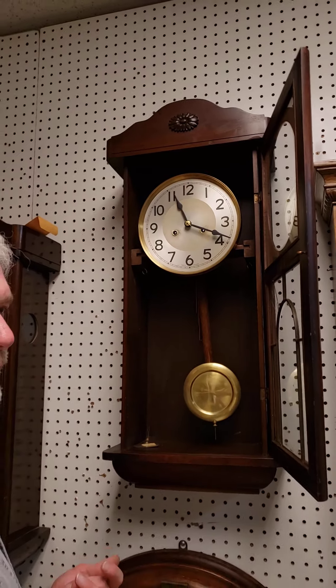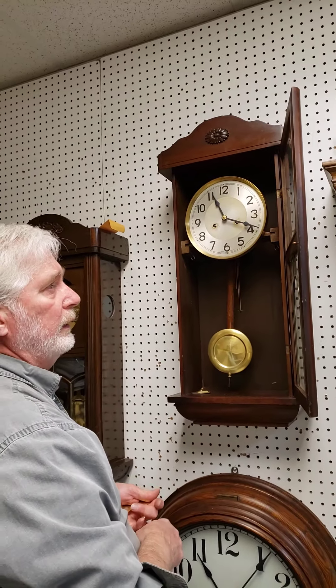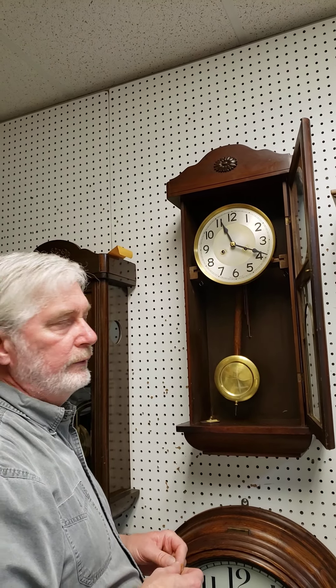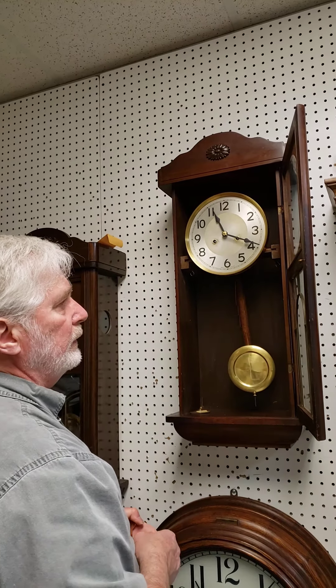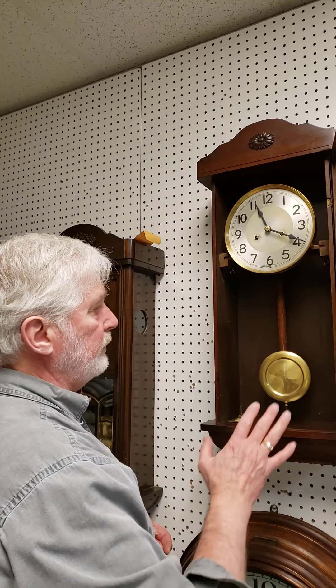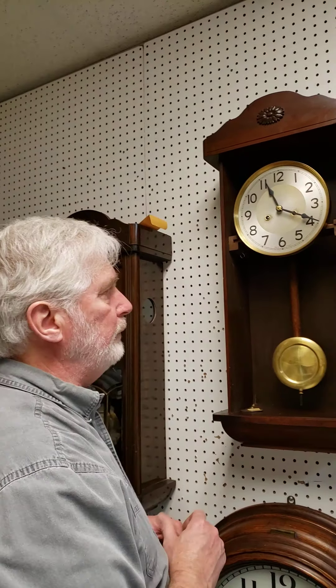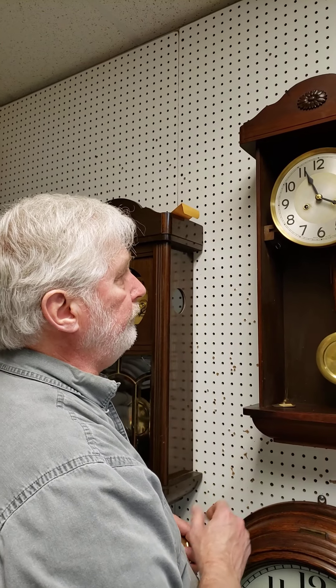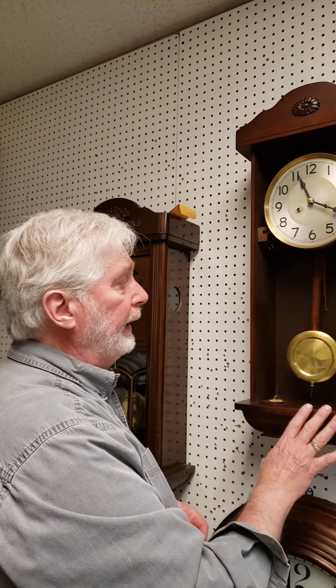It's absolutely critical that you set it every time you wind it. The accuracy on a clock like this is generally about a minute or so a day, either plus or minus — it will not be as accurate as battery-operated clocks. Over the course of a week it may be out five to seven minutes, so it's not unusual to have to reset it. Part of what we did when we serviced the clock is regulate it to make sure it keeps proper time. This clock has been tested for at least a week and has been running really well.